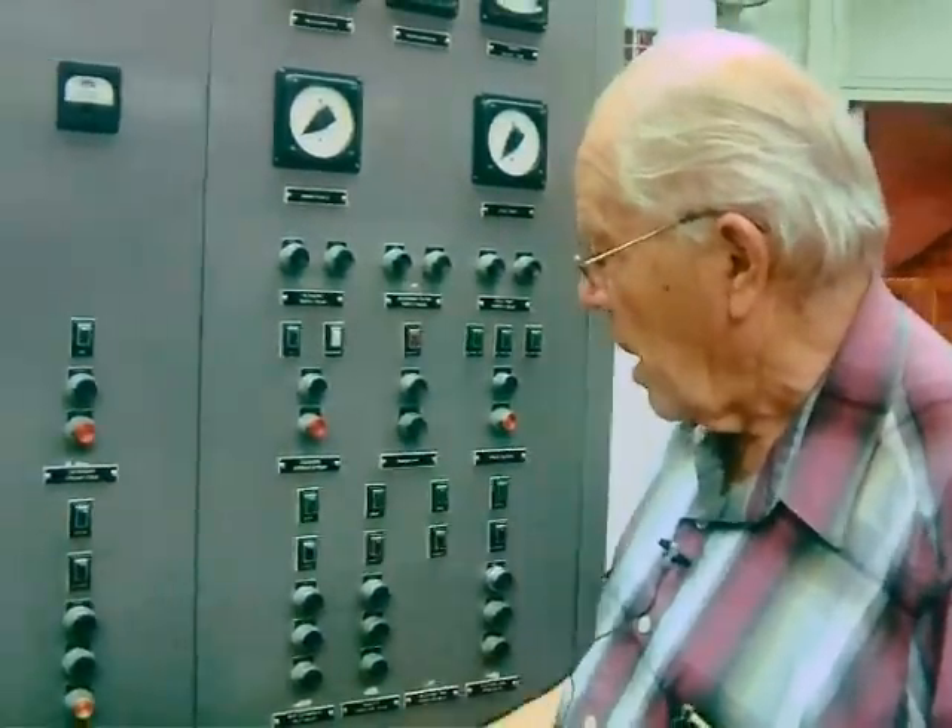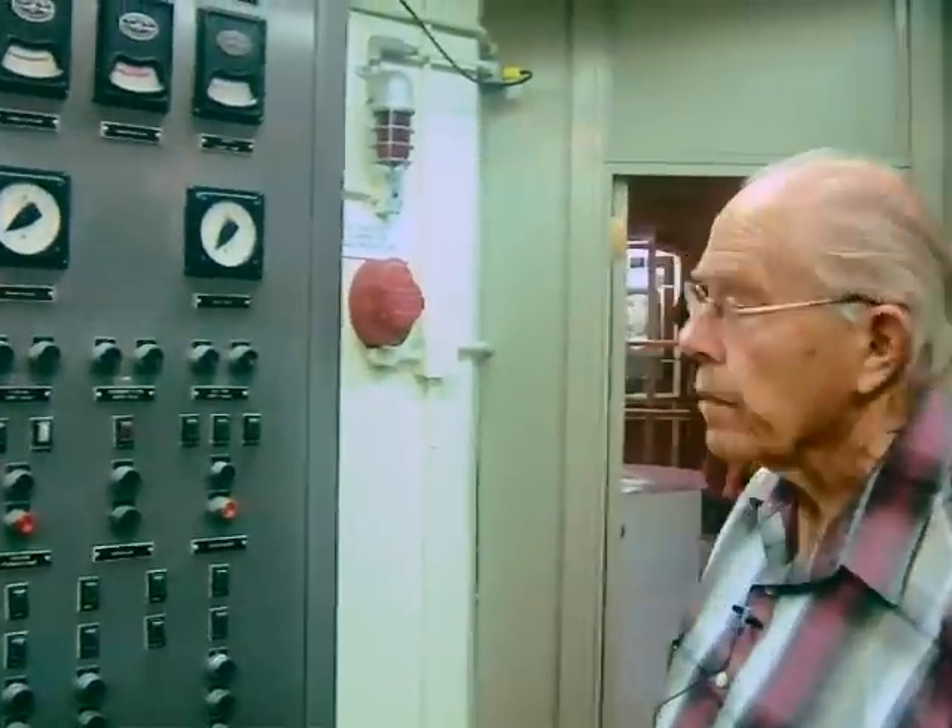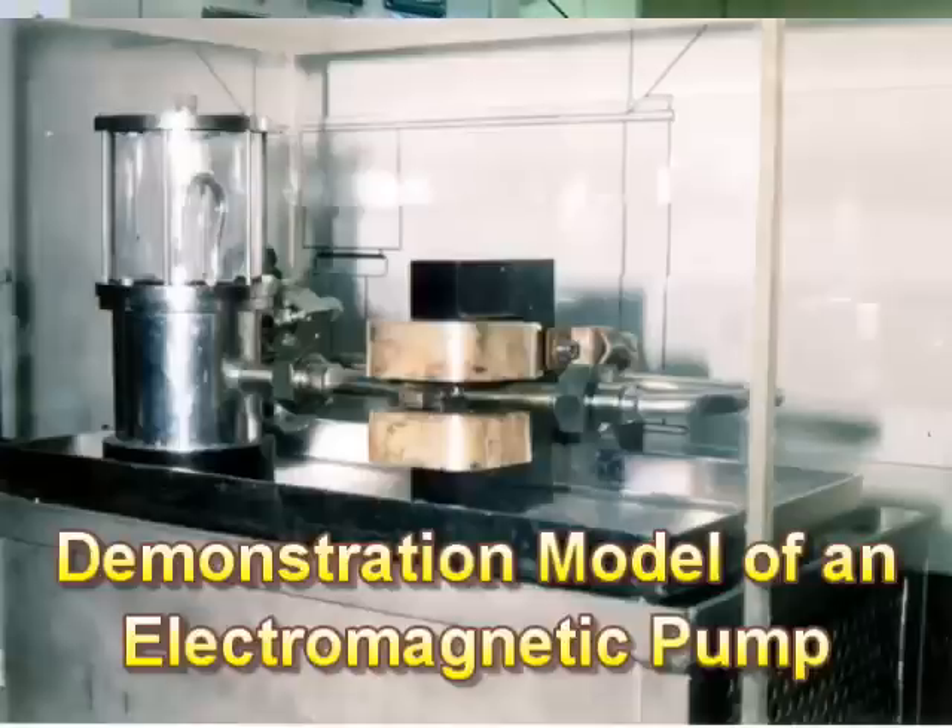Here were the controls for that. You had power valves, but you also had hand cranks to override them if you had to. An electromagnetic pump — you put current through one direction and magnetic force in the other direction, and it gives a thrust to the contents of what's in the pipe. So it's a pump without any moving parts, and it worked very well. However, it used a tremendous amount of electrical power and it was hard to get enough rectifiers to drive it. When they got over to EBR-2, by then they had developed alternating current electromagnetic pumps, very different than this one.